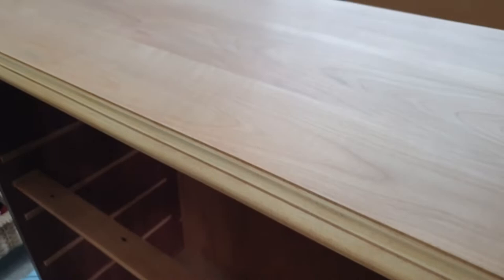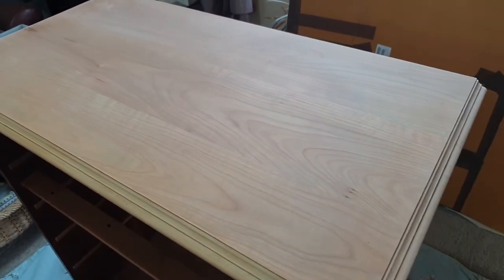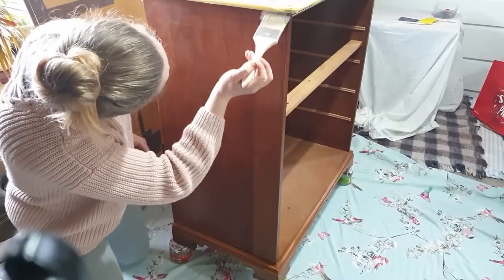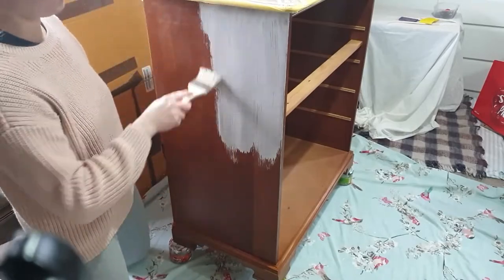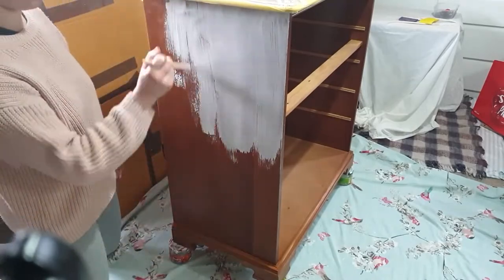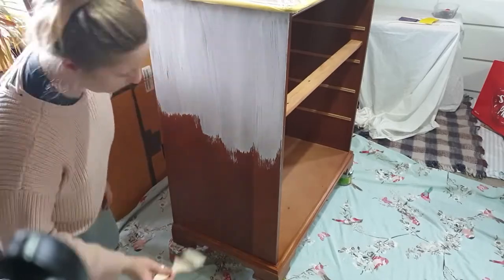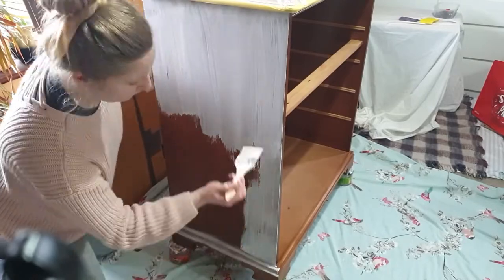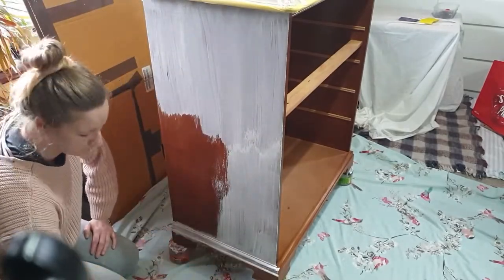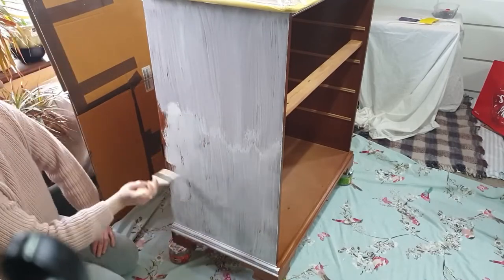As you can see, my effort really paid off, because it turned out to be a gorgeous veneer top. After the top was done, it was time for me to prime this piece. I like to do the top first, just because when I'm sanding the top down, sometimes it turns out to be in worse condition than I first thought, and if that's the case, I can just paint and prime the whole piece together rather than coming back to it at the end.